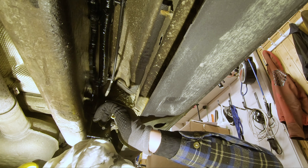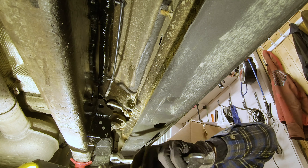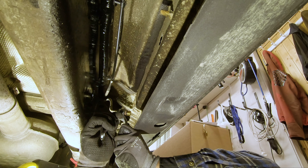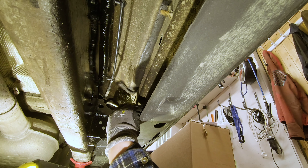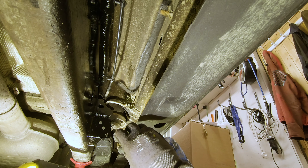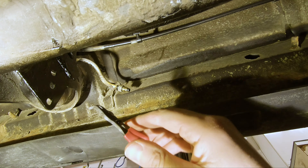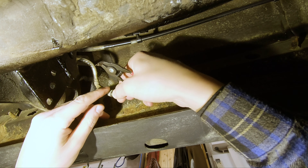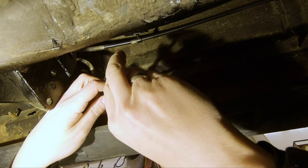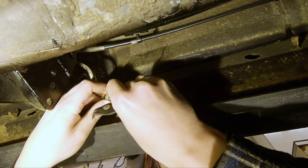I'm going to take the valve off here, then remove the valve connection and clean it up a bit more. It's a 22mm and a 12mm. One part is out, so this puts the connection a bit backwards — then you can see the olive. You need something to pry it off with. I like these small C-clip pliers. The split olive has a groove which barrels down into the pipe when you tighten the connection, so you need to pry it open before you can take it off.